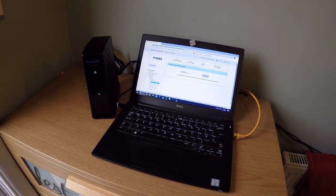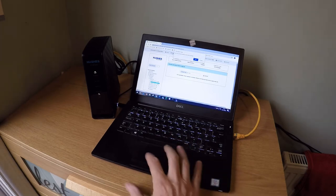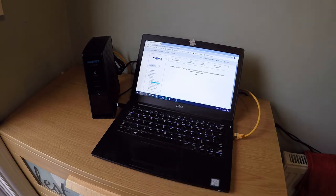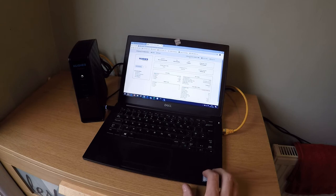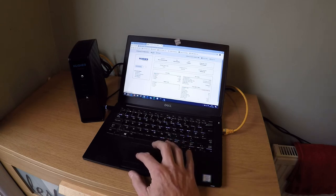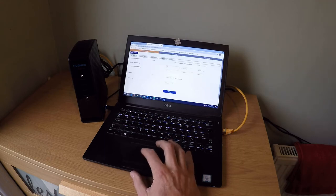Browse your PC to find the SBC Config supplied by Hughes. Once uploaded, reboot the HT modem. Once the HT modem has rebooted, click on the home button, then click Install. This page displays the information uploaded by the SBC file: the required satellite and antenna size. Latitude and longitude must be entered by the field engineer for the desired location. Next, click Submit.